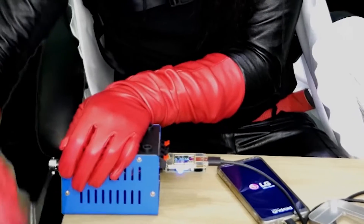It's producing 5 volts. If I spin it fast it's 5 volts at 0.449 amps. It doesn't matter if I spin it any faster - it's stuck at 0.4 to 0.2 amps. I can feel the resistance of the handle but it's not very consistent; it doesn't let me lock onto the resistance and just slips away. It says it can power a USB fan - let's find out. Look at that, it spins and works! 5 volts at 0.2 amps.